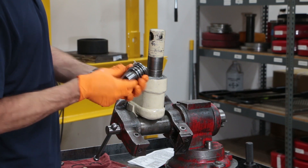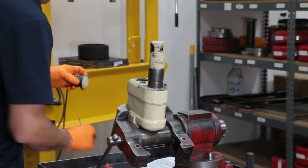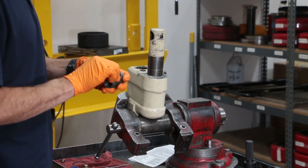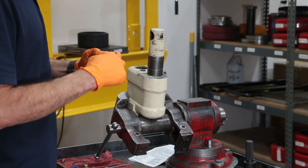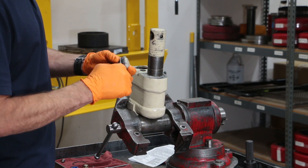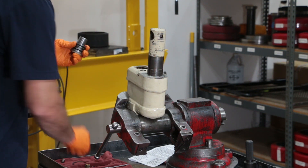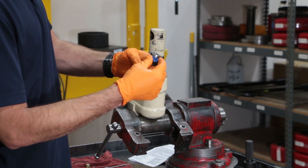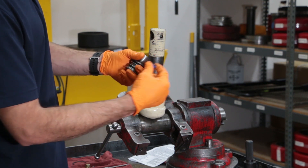After I've got my backup rings in place, I can take my O-rings and install them right next to them on both sides. Now that I've got my O-rings in position, I can install the piston U-cup. Same as the larger ram U-cup, you want that with the grooves facing down toward the pressure — the wide side facing the pressure.